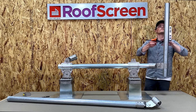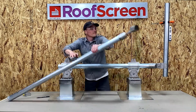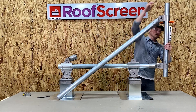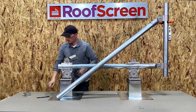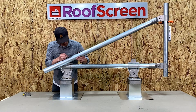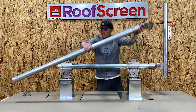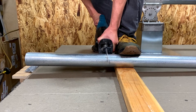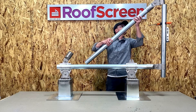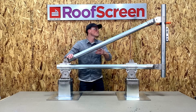Using a torpedo level and a quick clamp, make sure the vertical tube is plumb, then use the quick clamp to hold the diagonal member in place while you slide it on — this keeps it from sliding too far down. Slide the A13 of the diagonal member over the vertical tube and fasten it with tek screws at the distance from the top of the tube as specified in your shop drawings. You may need to cut the pipe to its proper length to keep the vertical tube plumb; mark it right before the connector tapers and use a skill saw or a Sawzall with a metal-cutting blade. Remember your ear protection when cutting steel. Slip the now-shorter diagonal tube and connector onto the vertical, then into the A12 assembly, making sure the vertical member is plumb.